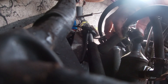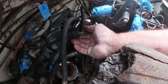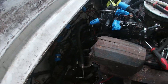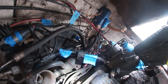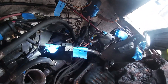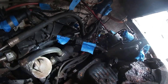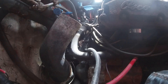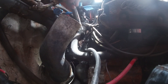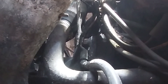All right, that went pretty easy. Those are going to have to come out and I see some electrical right here. I want to release and mark the ground cable right there. I'm going to release that and put those back on there. I believe that's on the back of the starter — can't quite see it, but usually it is. May not be, might be on the bell housing.